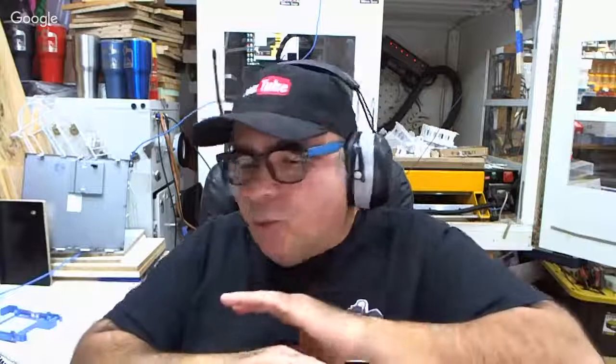And the pulley system, the reason why I want the pulley system in there, for those of you who aren't following along, is in the horizontal, I've got it to work at 400 inches per minute, which is ridiculous. You don't need that speed. But in the vertical, I'm maxing out at 100 before it binds. My goal is to have it work in any position at 200 inches per minute without a single issue. And I've yet to lubricate the screws or perfectly align them, so there's still that. But there's 70 pounds on the gantry pulling down. I don't want that kind of weight. And when I turn it off, it actually pushes the screws down.